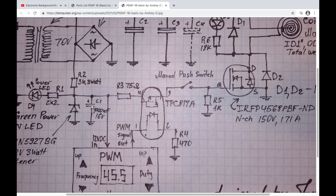You also have a filter here — a 1,000 microfarad, 16-volt filter capacitor for the 12-volt line. You also have a 75-ohm quarter-watt current-limiting resistor for the MOSFET gate, used to limit current into the optocoupler for your gate drive.